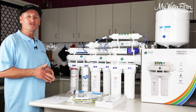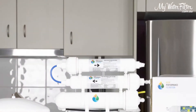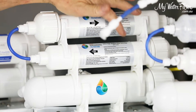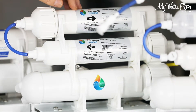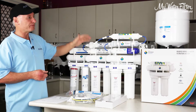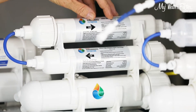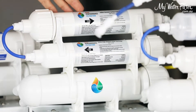Then, if you've got desires for a pH level above what the four stage can do — above seven pH — you might want to take a look at this five stage. It's a beauty. This is going to elevate the pH of the water right up, more like probably nine, and then as the alkalizer cartridge wears down in time, we'll start coming back to about an eight pH. But be aware that's what this is for — to create higher pH water. After the water comes out of the membrane, it collects in the tank. When you hit your faucet on the sink to get water, the water's coming out of the tank, it goes through the alkalizer picking up mineral, elevating the pH, it goes through coconut carbon, and it's beautiful for making the water nice and sweet before you drink it. It'll make very tasty water, I promise.